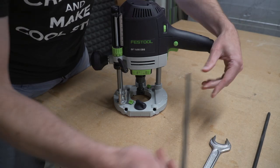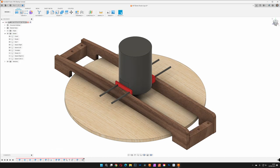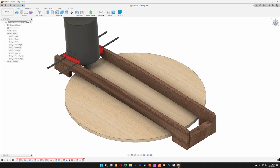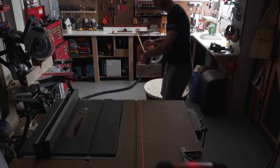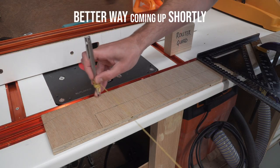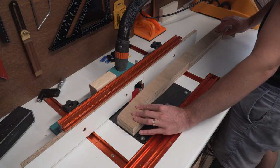So, easy right? After a little back and forth, we decided the best way to guide the router was using the guide rods that it came with. These will keep the router as low as possible, and the base can also sit between the rails to restrict any forward-backward movement. Being two cylinders also means the router will stay stable on the arc. By mocking up both the cover and the router in CAD, we can see how tall and at what arc we need to make the rails. To draw the correct radius onto the rails, Michael came up with this harebrained scheme — first he measured out the radius using a laser and tape measure, then put a screw in our desk at a measured point and using the old string technique drew an arc. We then cut out the arc at the bandsaw, sanded smooth, and copied and pasted at the router table.